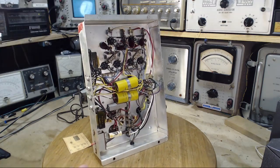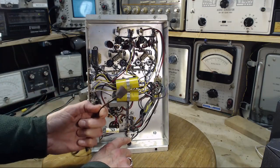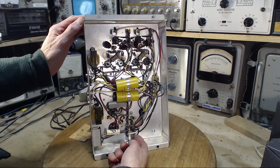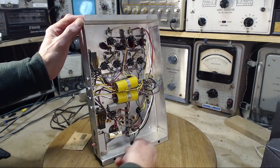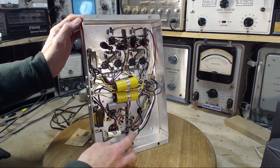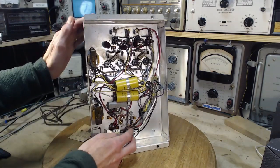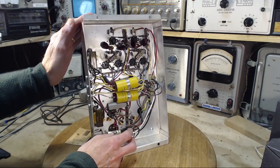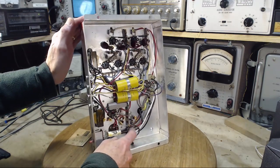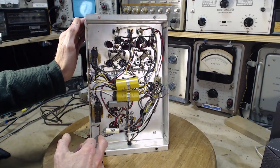Let's follow the power wire in it and see what they're doing with that. So here's the power wire coming in. It's just an old-fashioned, non-polarized, any which way plug. Let's see, the wire comes around to this terminal, and the other one comes around to this terminal. So these 2 terminals, it's definitely not plugged in. These 2 terminals then are where the power comes in. Neither one is grounded that I can see so far, but I have this capacitor to the circuit breaker.